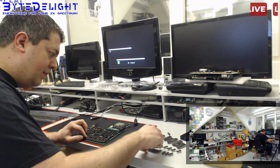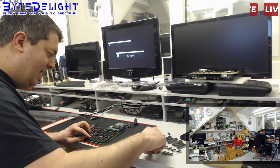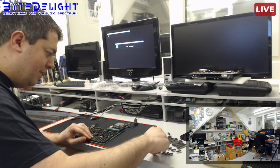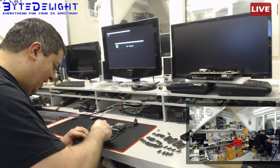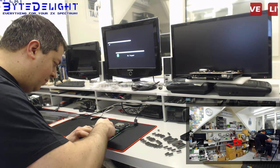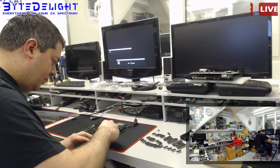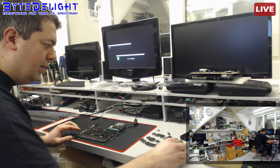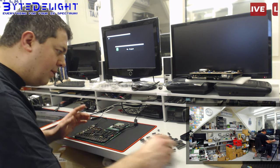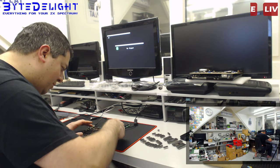Sometimes it's fun to test the power on the board in between before you put in all the chips. But if you like strange things on your video output and you're not scared easily, then you could do that. I had some cool effects with a couple of these. For example, when the clock going to the Z80 was a lot higher than it should be, and of course the rest of the board as well, that caused seeing four tiny speccy screens at the same time. It was quite cool to see.